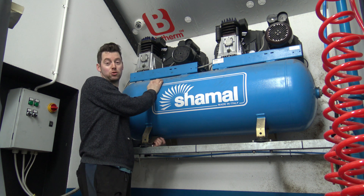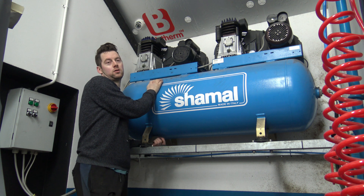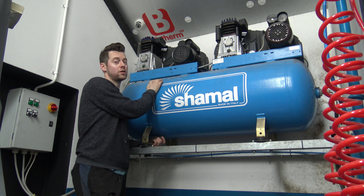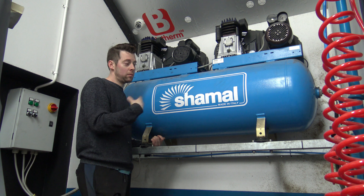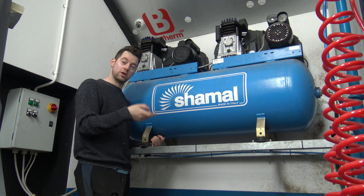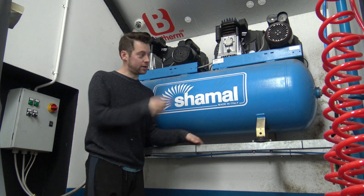It is a simple video to demonstrate mainly tumbling the tank to clean it. What I have done is made my own media using basically coarse sandblast grit, along with metal objects like screws and nails, and also linseed oil - so it was like a mixture.